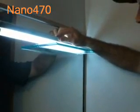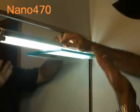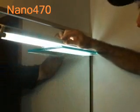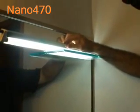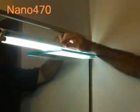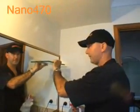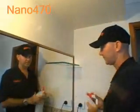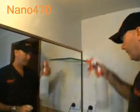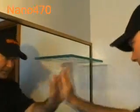So we'll just hold the light here for approximately 60 seconds and get a second cure from a different angle from the top, just to make sure that the whole joint is nice and cured. And then we'll do the same from the bottom again, give it a second cure about 60 seconds from the bottom. Okay, we've done our second cure and we're quite happy with the strength of that. As you saw from the previous demonstrations, it can hold quite a load, a lot more than what the bathroom is going to give it, or a tin of hairspray is.